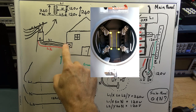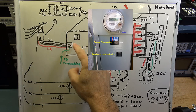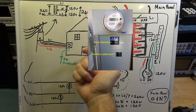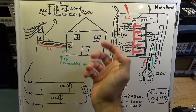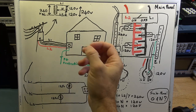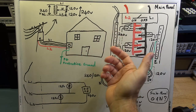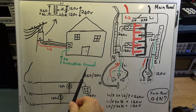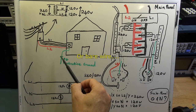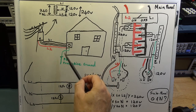In some cases you can have a breaker box on the outside of your wall so that some electrical circuits are on the outside — the main switch can even be switched from outside the house, with a pass-through into a panel inside. Be wary about everything here because even a small subtle mistake can be critical, which is why you shouldn't open your breaker box and try this yourself — it can be very dangerous. You'll also have a protective ground: a green, yellow, or green-yellow wire which goes to ground as a safety protection, to bring any stray shorts down to ground.